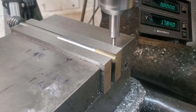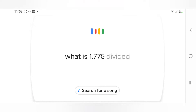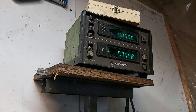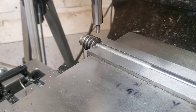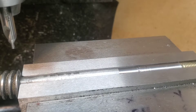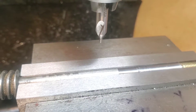I'm pretty sure I should be able to do this math in my head, but I always like to double-check my measurements, so I jump on the phone quick to confirm the number. Now that I've got the correct number I'm going to roll over to center, then over to the other end and use the wiggler to find the edge of that gear. We did a blueprint off of this, so I'll find that edge, roll over to where my measurements are, and peck those two holes with the center drill.